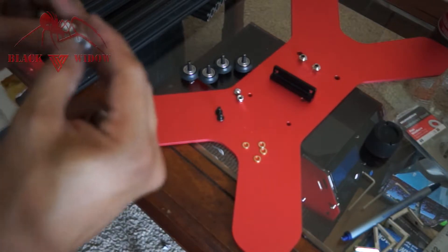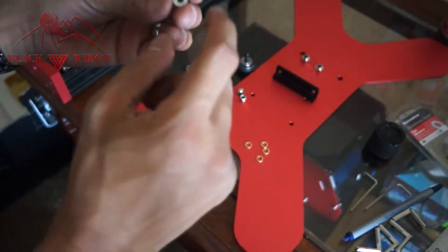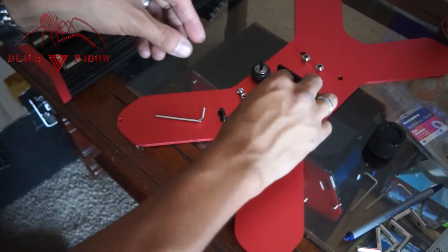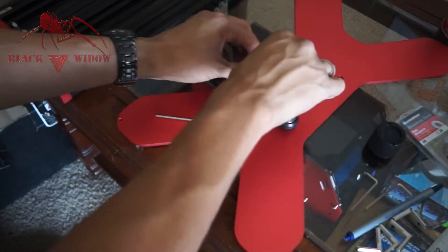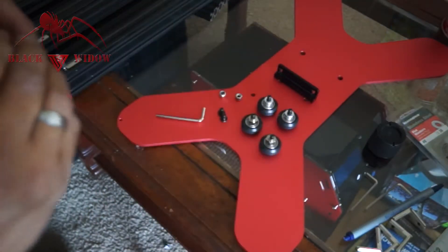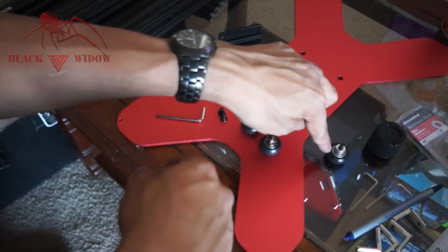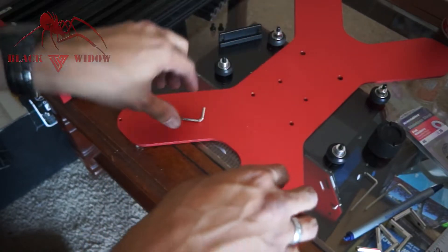Don't put your parts bag away — they did include spacers, but they're metal now, not nylon. I'm going to add some silicone to these as well. The next step is to put all the brass washers through on all four bolts. Two of them are going to get the metal spacer and then two of them are going to get the eccentric nuts.